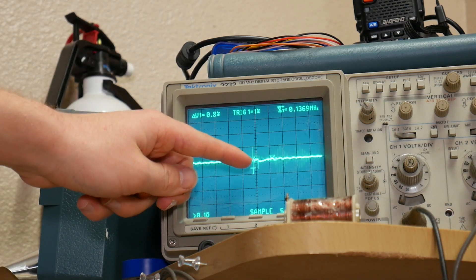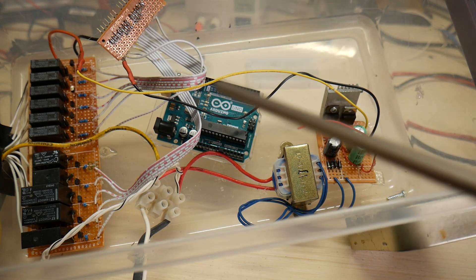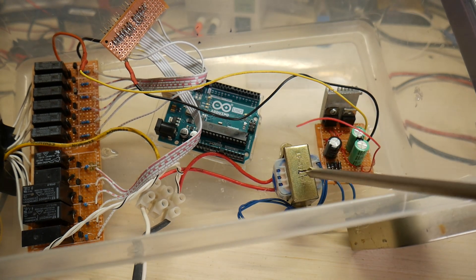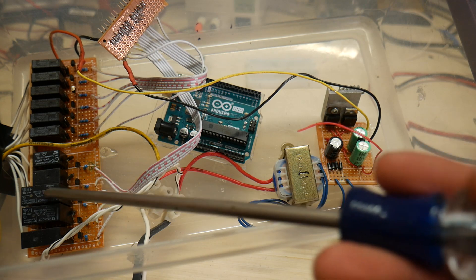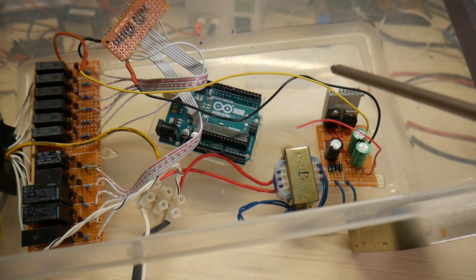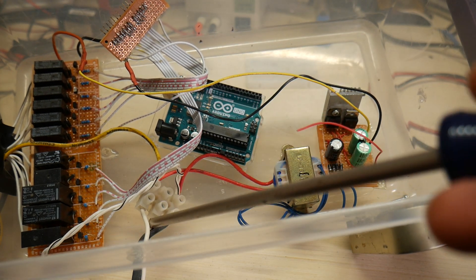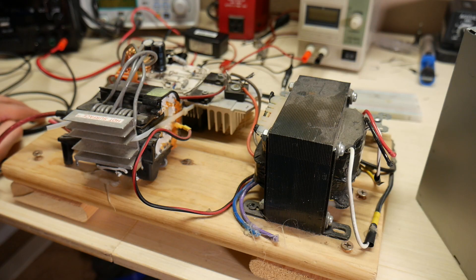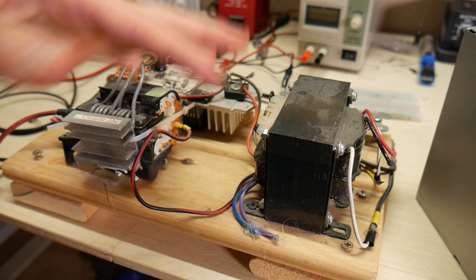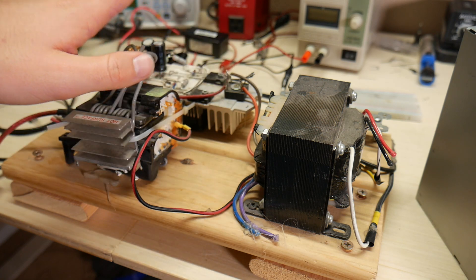This noise problem is especially bad when your circuit isn't drawing much current. It also works well to use a linear power supply in smaller low-current projects, like my old Christmas light controller, especially if the transformer is outputting voltage close to what you need. This transformer is 13 volts, and I need around 12 volts, so I've got a linear regulator here — it's not wasting too much power, and even though it's not as efficient as a switching adapter, since it's running off the wall I'm not too worried about efficiency. When it comes to higher current electronics projects, a linear regulator will not be good — it'll waste a lot of power, like in my ZVS flyback driver. If I tried to put a linear regulator there, it would just get very hot and waste a lot of energy.